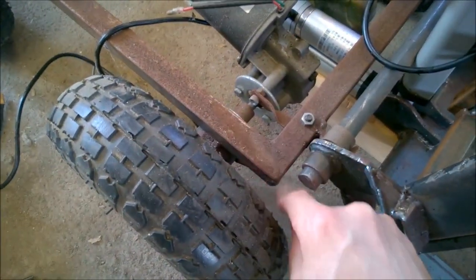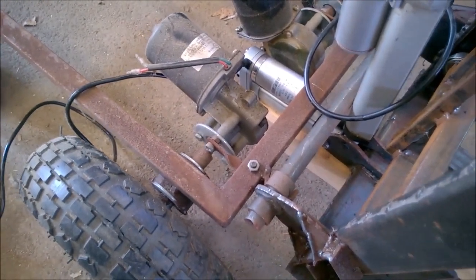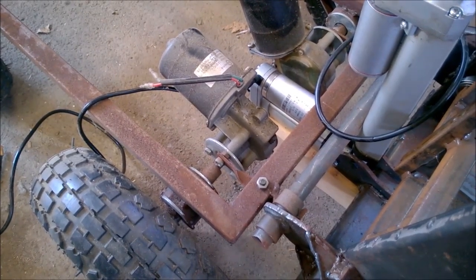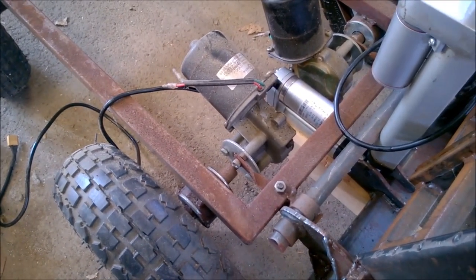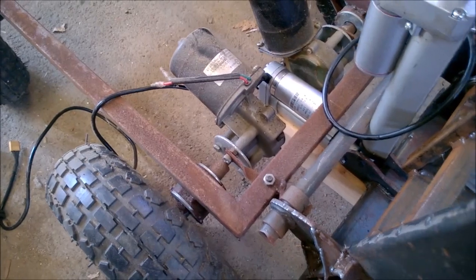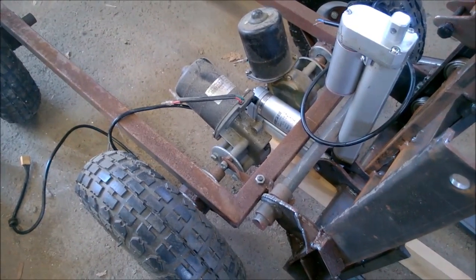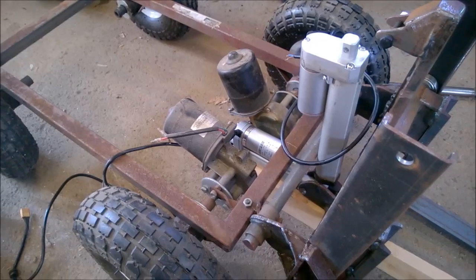And this surface rust that you see on everything, it's pretty light. I've already kind of brushed it off just with a hand brush. But this was stored in the garage, a heated garage the whole time. But in the spring, I keep it 66 or 67 and must cross the dew point once in a while, 'cause it seems like this happens in the spring. Also, there was probably like sawdust and stuff sitting on top of it, which kind of captured the moisture and held it. So, it's not anything that'll cause a problem. It's just another stage of having to clean it before painting. So, kind of a pain in the butt, but that's what you get when a project sits.